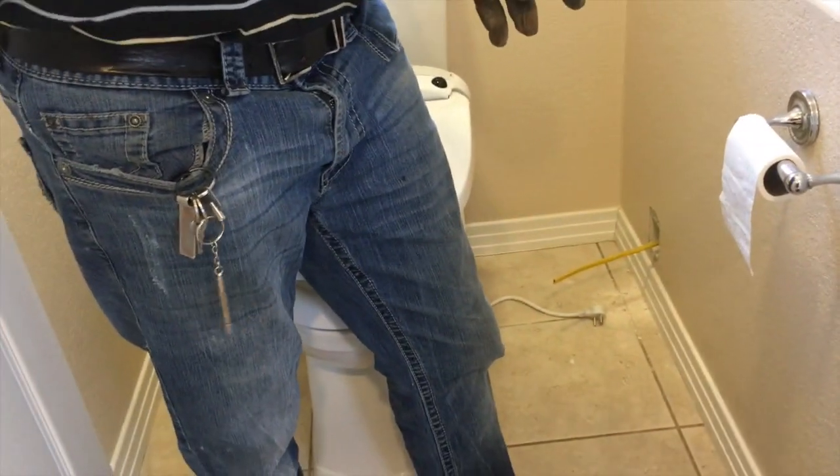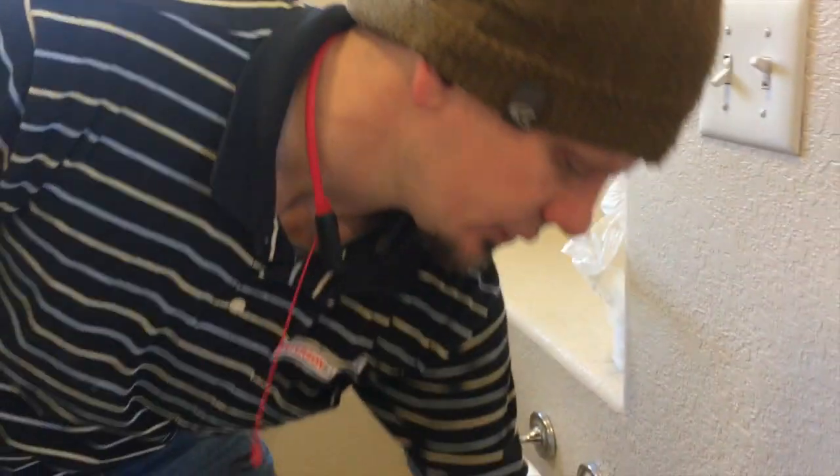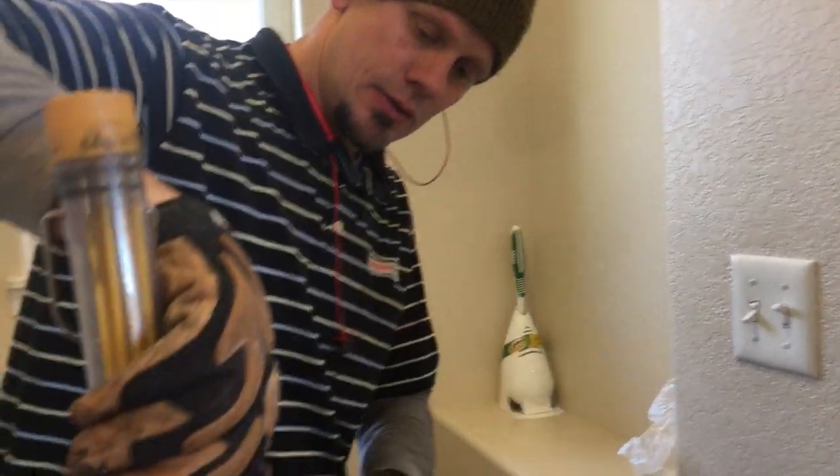So this was definitely the easiest way: drill a hole slightly, go down there, tap, go back in reverse, use a keyhole, drill a hole, catch the fish rod. Once that came through, I taped it and pulled up the wire. We'll go down and show you the rest of it — follow me.